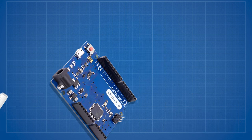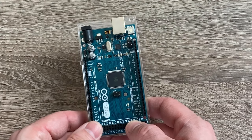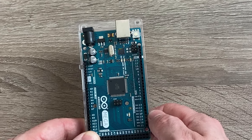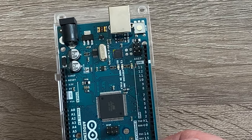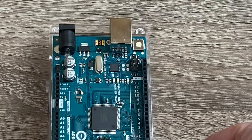I don't have a Leonardo, so I'm going to use this Arduino Mega, which is essentially a beefed up Uno. To make it act like a keyboard when it's plugged in, I'm going to have to change the firmware of the USB controller so it can pretend that it is a keyboard. But obviously before I do that, I'm going to need to write the code to it, because once it thinks it's a keyboard, I can't write to it anymore.